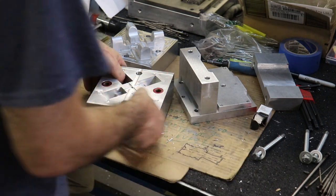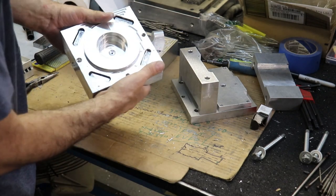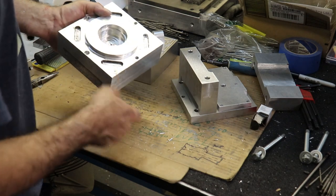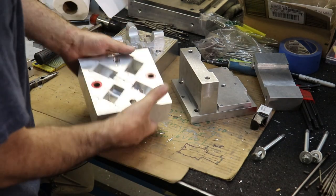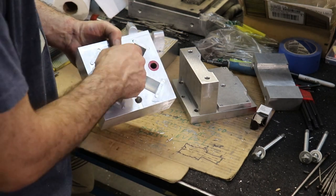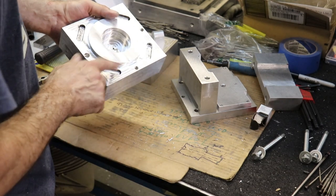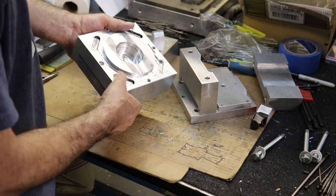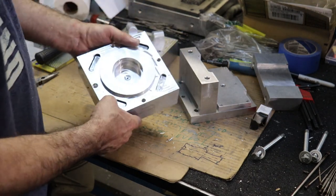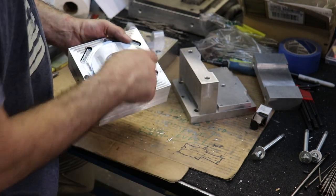Oh, and I also, off camera, put these aluminum wedges in, which was quite a challenge. Some of them required a bit of force to get in there. So if I have to adjust this mold, I'm probably going to have to machine these locking taper keys out of here. I was worried that they may push out, but after the amount of work and hammering and clamping and tonnage I've used to get those things in there, I think they're going to stay in there forever, unless I machine them out, which I can just put back on the mill and machine these aluminum parts out.